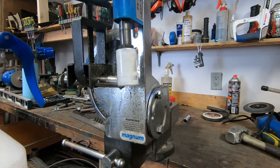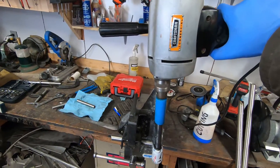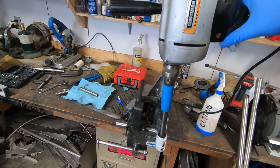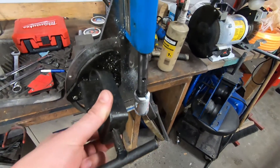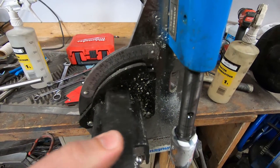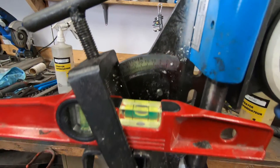Initially I was using the electric Milwaukee drill which was great but it did try to break my wrist once, so I switched over to an older half-inch chuck drill with two handles — it was more stable and more comfortable to use, although I think it does spin a little bit too fast. One problem with this notcher was it wasn't making completely perpendicular notches. To fix that I took a little time to calibrate it — I found it should be dialed back to about four degrees, and at four degrees it actually does a better job making perpendicular notches.